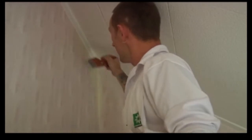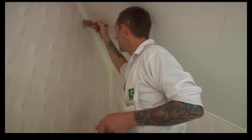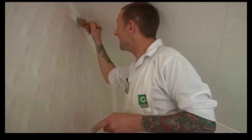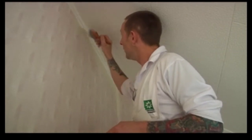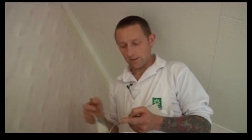Generally, your kitchen has smaller windows above the sink, so light is the main factor. Are there special types of paints you have to use in the kitchen? Basically, something that's washable — a semi-gloss or a full gloss. A lot of the wash-and-wear paints, as long as they're serviceable. Obviously you want a semi-gloss on the ceiling — if you're cooking with gravy and fats or anything else, it builds up over time with fumes on the ceiling. Just on these walls here, we're using the same paint at the moment because there's a lot of ventilation, a lot of windows, so it's not really an issue here.